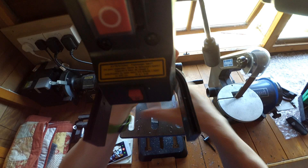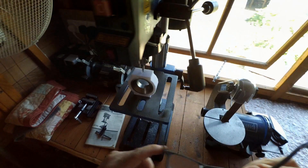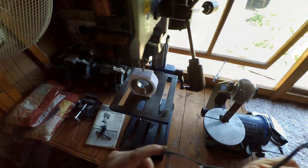And it worked really well. Annoyingly I haven't got any images for you of the perfectly drilled and tapped part, but it was perfectly drilled and tapped, so I'm really pleased with this technique. I've dispensed with the milling machine and I've got a bit of plastic instead. You don't even need a vise — there's no setting up except to put the part in the jig. If anything, it's even better than the milling machine — in fact it is better. And it's easier and faster.